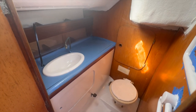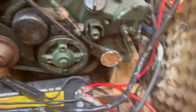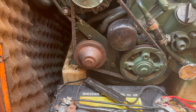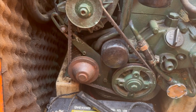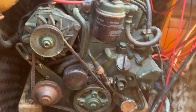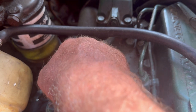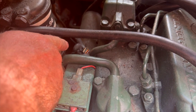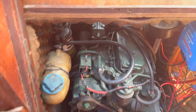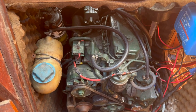The impeller's changed, there's a new raw water pump on and a new circulation pump on. I've got the rebuild kits so I can start on that. But now I've got to trace that impeller blade that dropped off. I've got to go and take the heat exchanger off - it's down there. I'm going to take the end off and see if I can pull the core and get it that way. If I can't, I'll have to take the heat exchanger right off, which will make it a little bit more difficult.